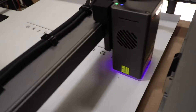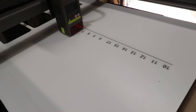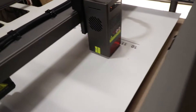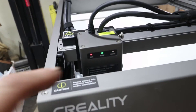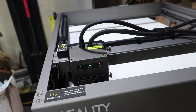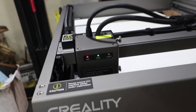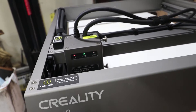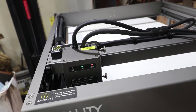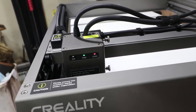We're about done with the first row. Now it's starting on the second row of sockets. These three status lights are pretty helpful — they give you the status of the laser. Right now the air is off because it timed out, but there's no fire, which is good. However, the lens is dirty. I'm getting the dirty lens warning probably every four to five cuts, so I'll show you what I do to clean it.